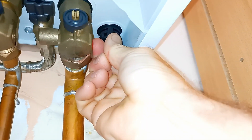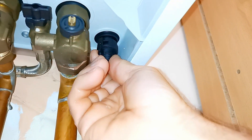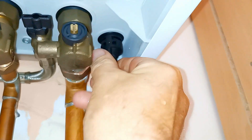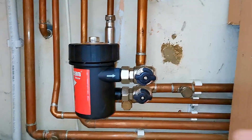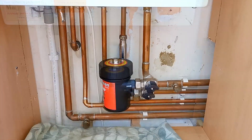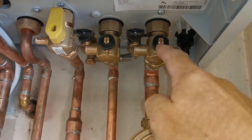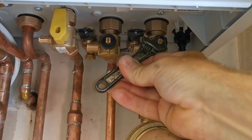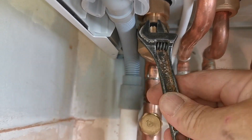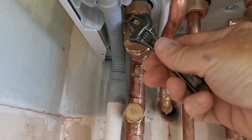The drain off device has two handles on the sides - you twist it to open the valve and water starts coming out. It clicks and locks back into position when you turn it back, but these can become stiff and don't always work as they should. One of my favourite ways to drain the system is to use the magnetic filter. Depending on where the boiler is installed, I may also consider closing both the central heating flow and return valves, because if I have radiators or pipework above the boiler I might get a sudden gush of water when I remove the sensor, and I don't want water getting onto any electrics.